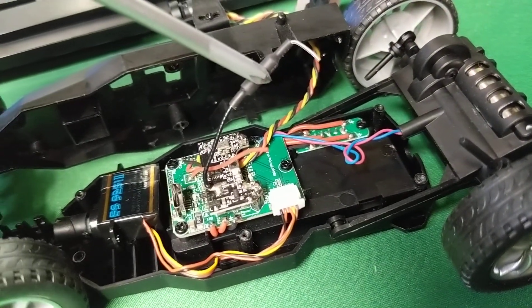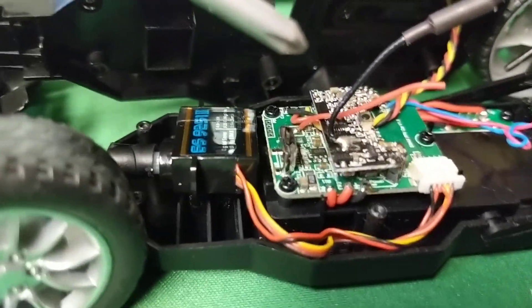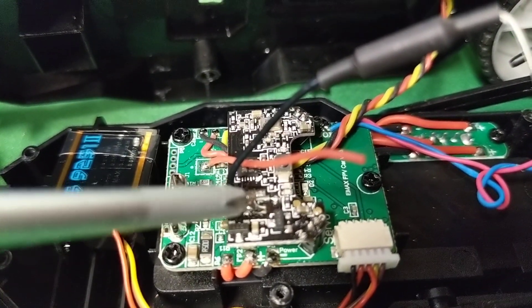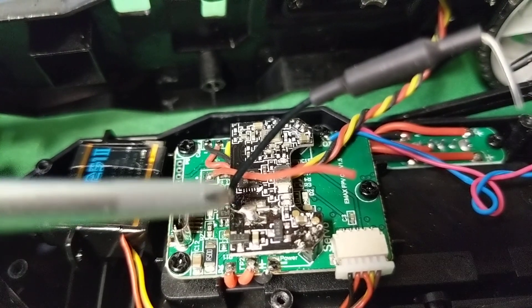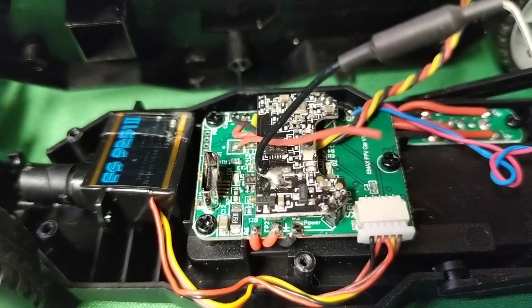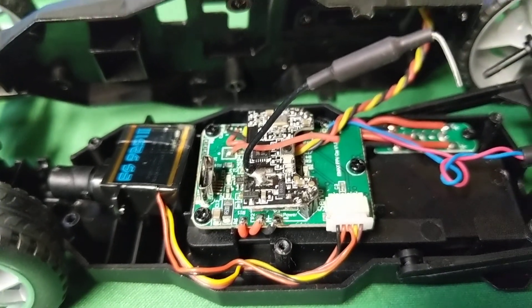One upgrade that might be worth doing is getting this to circular polarized. It would require knowing what you're doing, but it's possible to solder on a new antenna — even a pigtail to an SMA — so you can put left-hand or right-hand on there. It might be worth doing for maybe two of us, so that we could go with two people on left-hand.